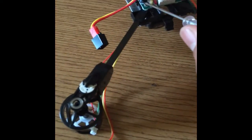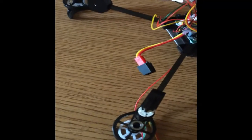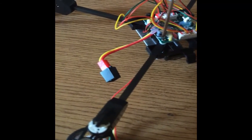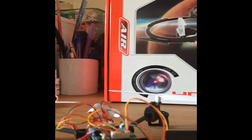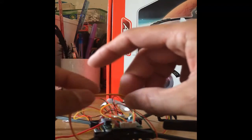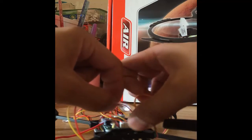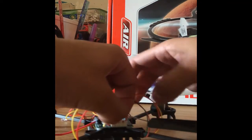There's the new arm. I just got to finish screwing this in. I'm going to put a battery into it after that and attach a blade to see if this actually works. So let's go ahead and finish that. That part's in there. Now we're going to put these wires where they belong. The yellow and orange will go over here — orange goes to the outside, yellow inboard. Your drone might be different than mine; if it is, just make sure you pay attention to where the colors match up when you put your motor in.